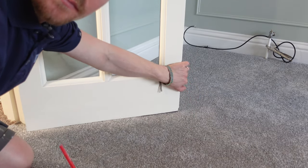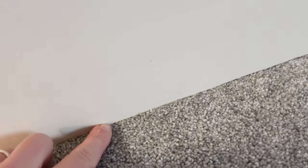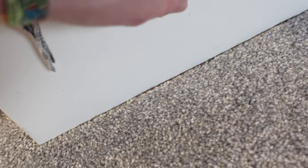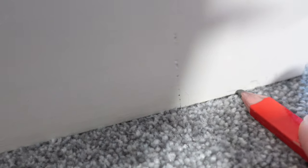We're going to be opening it and seeing where it's stiff. We can see it's very stiff along this edge here — it's a bit gappier along this edge. What I like to do is open the door all the way and see exactly where it's pulling. It's quite tight at this edge. It is actually still tight along this corner. So what we want to do is find a point where the carpet's touching the door and mark a line. It'd be the same if it was a laminate flooring or a wood flooring.